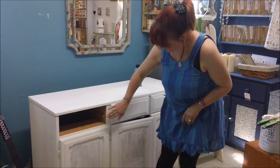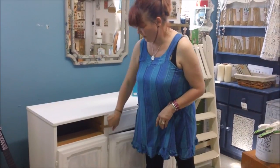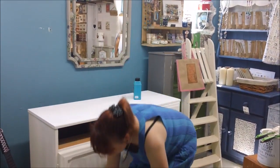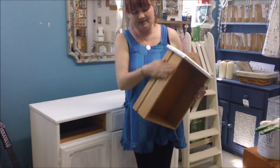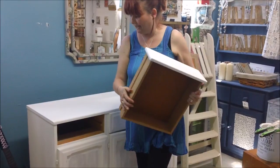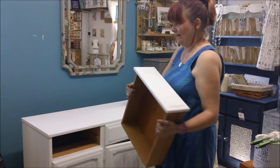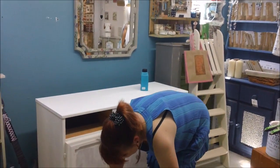So just to finish, we've painted just inside the drawers so that it doesn't particularly show on these at all. But sometimes you get drawers that sink in, and it's really annoying if you've got a wood edge showing when you finish it all. So we always paint just inside, and we always paint just the surface of the drawer, not the sides, for the same reason really that it's problematic with most drawers putting them in. If you've then added a layer of paint, it jams it, so I very rarely paint the sides.